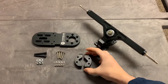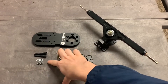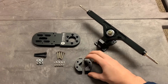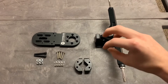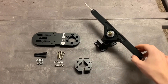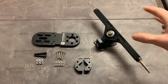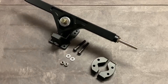The easiest way to install your motor mounts onto your truck is to first pre-assemble your V7 CNC clamps. We're going to loosely attach the bolts and not tighten them all the way at first, because we want to fit this onto the hanger and then maneuver the motor mounts to find the perfect position. If you tighten them first, you'll have to untighten them to make any adjustments, so keep them loose initially.